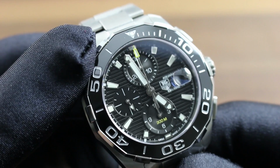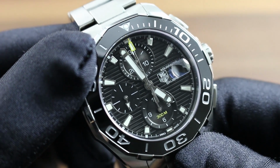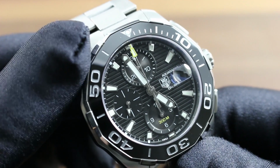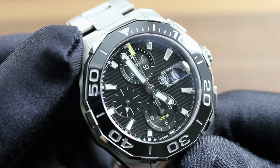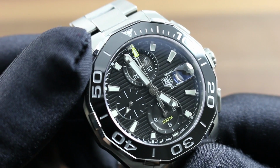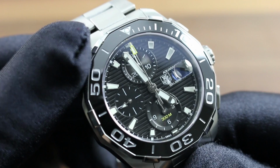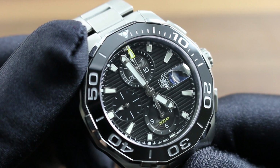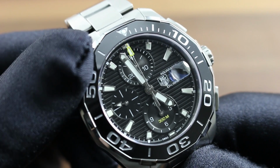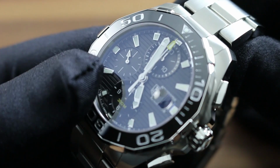It's also important to remember that a mechanical watch features a metallic hairspring that's extremely sensitive to magnetism. The watch should be kept away from refrigerator doors, powerful speakers, subwoofers, high-powered wiring looms, as well as professional magnetic resonance imaging equipment. Should you suspect that your watch has become magnetized, it's important to take the watch to an authorized TAG Heuer retailer where specialized equipment is available on site to demagnetize the hairspring and restore the performance of your watch.